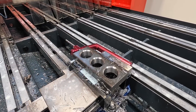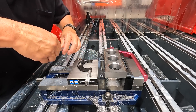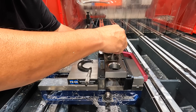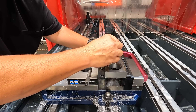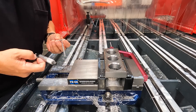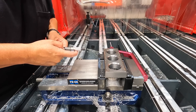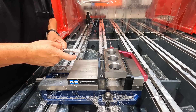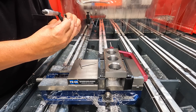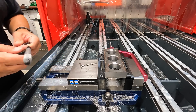I'm going to go ahead and grab my mic and snap a measurement on this to make sure we're still on size. We've got our mic and telescope gauge — let's give these guys another check. 1.781 is my target diameter — that is the official tap size for a 2 inch UNC bolt. And we are there: 1.781. Got a couple of tenths there to add up. 1.781 and 5 tenths is what our diameter is.